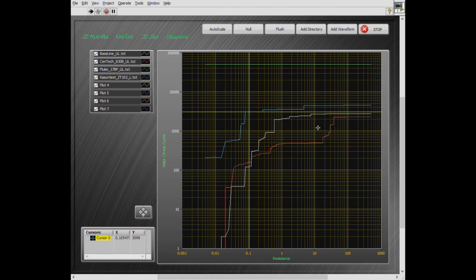Hopefully this gives you some idea how you could run a test like this. My plan in the future is to run some different meters. I don't think we'll have to spend the time to run all 50,000 cycles — if a meter goes open or reaches 1,000 ohms I'd just abort the test, because at that point the meter has already failed. It would really just be the quality meters that would take the time. I'm planning to keep the Fluke 17B Plus intact — I've verified it's still functional — and if we run into another meter with a switch that wears as well at 50,000 cycles, we can run the Fluke another 50,000 and compare. Well, I think that's going to be it. I hope you enjoyed the video. I'd like to welcome all you new followers — until the next test, later.